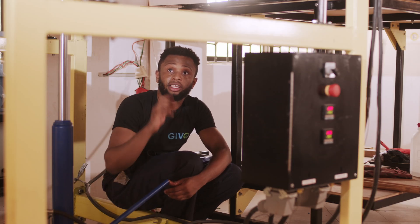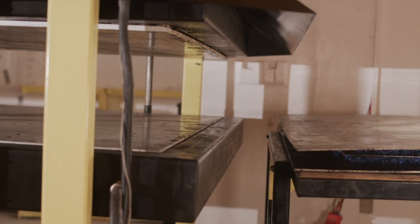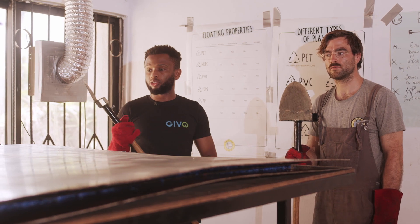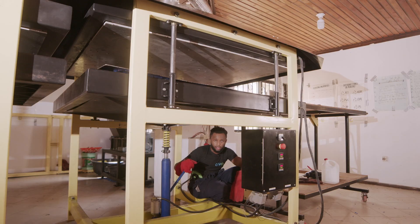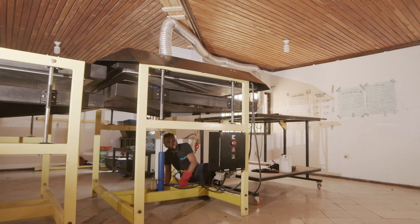So now I'm going to lower the heating bed just below the preparation table. This is our sliding tool. We're going to use this to push the mold into the sheet press. And to do this, you need to be two people and you need to be quick. So now we're going to lift up the bed till the spring is compressed.